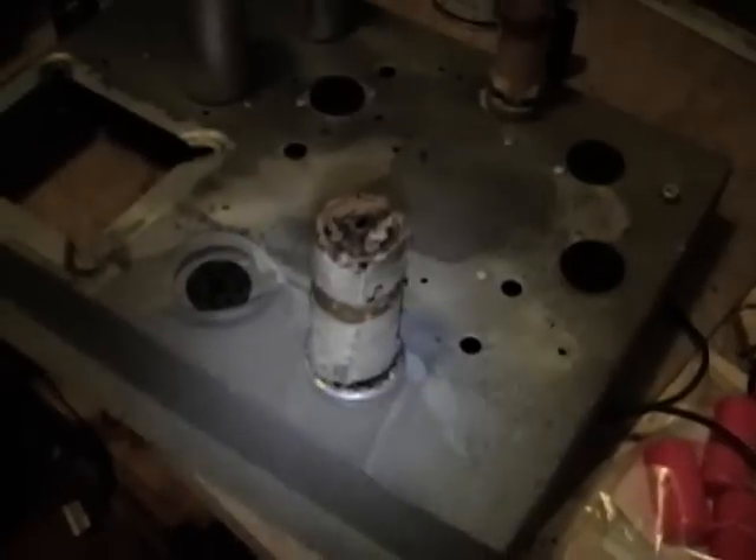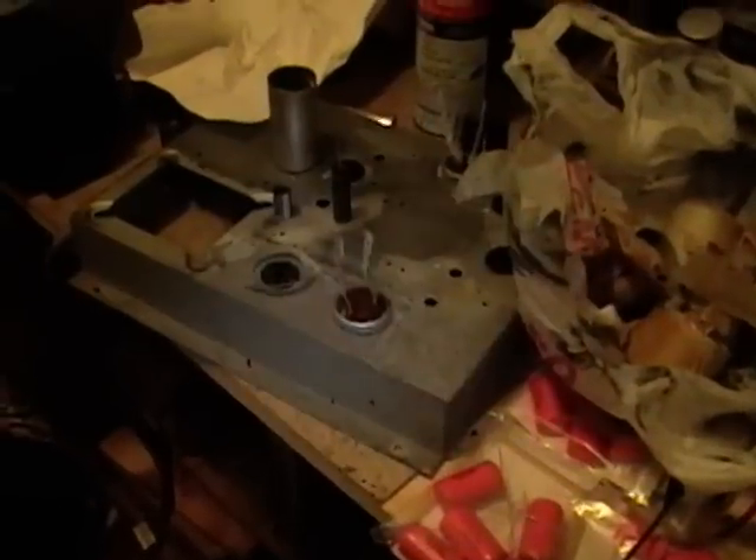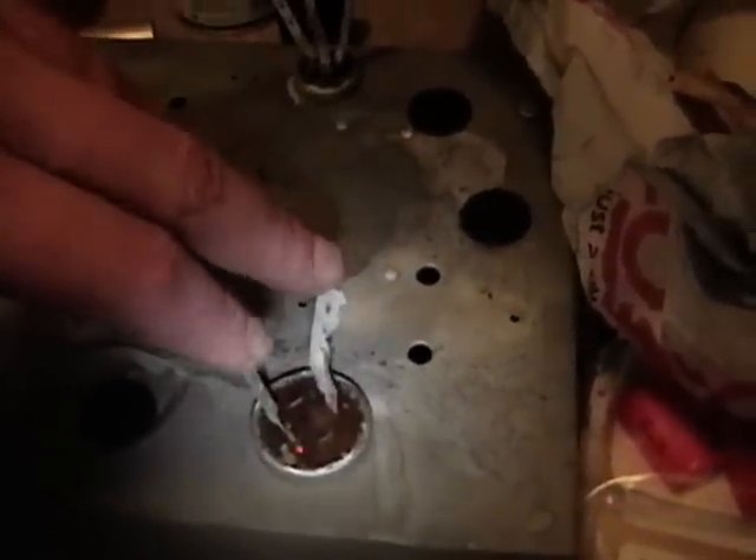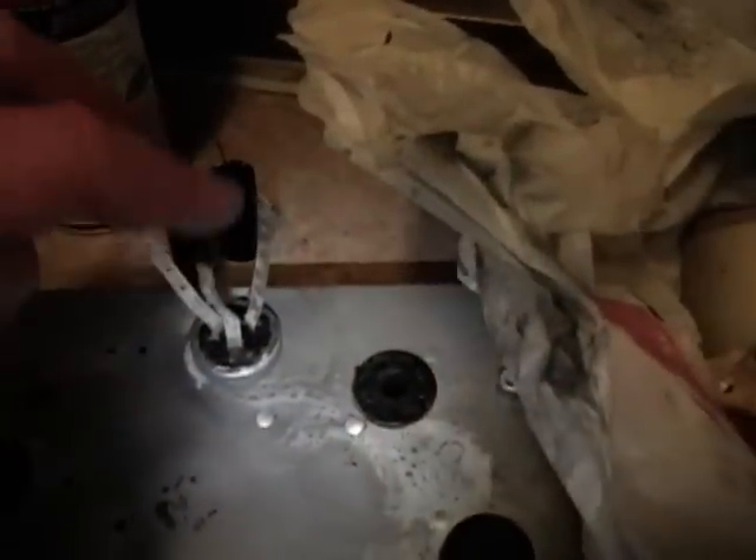I want to pull all that stuff off and get this down to just the base with three metal studs sticking up. Here's what I was left with after unrolling: basically a roll of paper material damp with electrolyte and a crystalline metallic layer, probably to increase the surface area. This was a two-section cap so I've got two prongs plus the can is ground, and this other guy I've got three prongs.